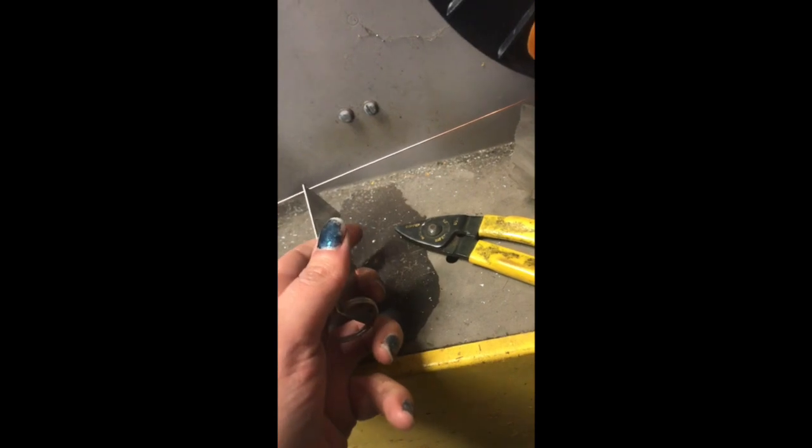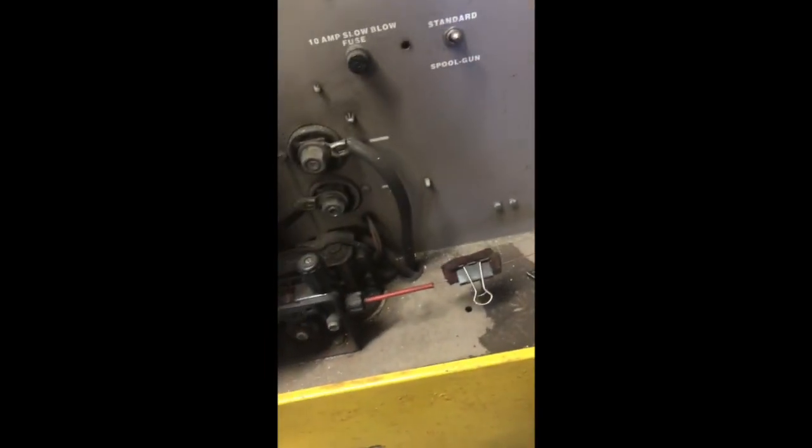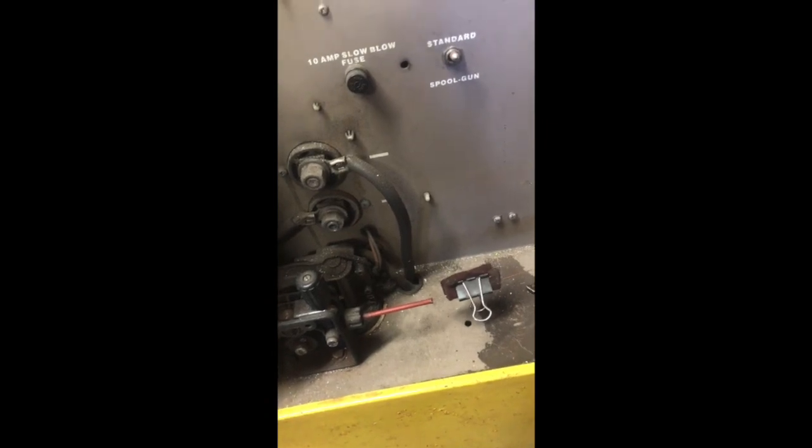Open up the side panel here. Here's the inside of the welder — the wire, and there's your welding chart. Right here is where your feeler gauge would come in handy. This one is labeled, so we're going to use 035 wire, but if you didn't have that label, you can use the feeler gauge — put it on here and it fits on the 035. Right here I have a piece of Scotchbrite. Because sometimes when your wire spool is sitting in your shop it'll get moisture on it, it'll get a little rusty, and that'll keep it clean before it goes into your lines before you weld. Just a little tip for you.